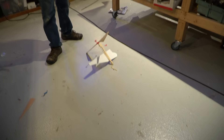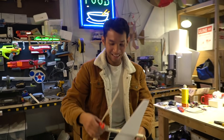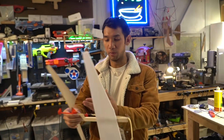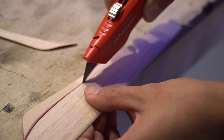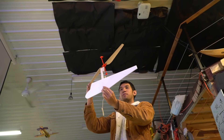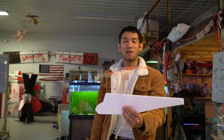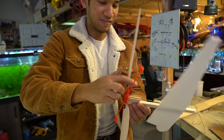It almost kind of flies! It's stable because it descended down without flying sideways like a fixed-lock propeller would. I think we should cut the blades down a little bit — my fly bar stabilization system is about right and works. I'm going to take some pitch out of these blades; I think they're too aggressive. Take two — trimmed blades. That's worse, I went the wrong way. It's really unstable because the fly bar is working in the opposite direction.